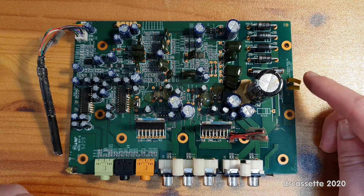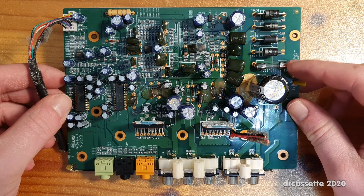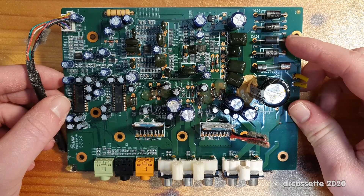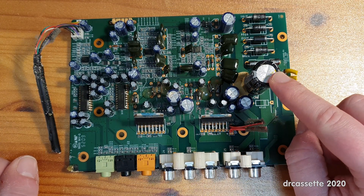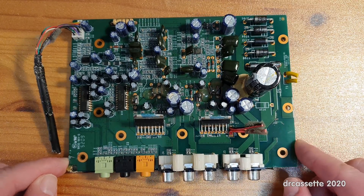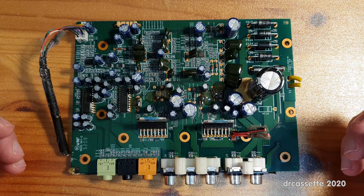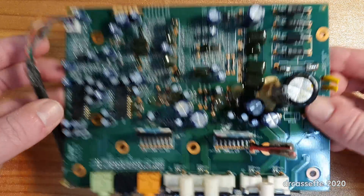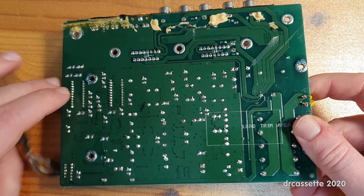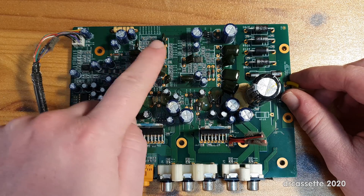The transformer delivers about 14 volts into this board. We have a 5 ampere fuse right there, and then a nice beefy rectifier bridge made up from 1N5401 diodes. There is the main filter capacitor — 6800 microfarads at 25 volts. There is 17 volts present right here, so that's the main supply voltage. This is disappointingly a dual-layer board. Here is the underside — not much going on here. Got a ground plane, and there is the star-shaped ground point at the main filter capacitor.